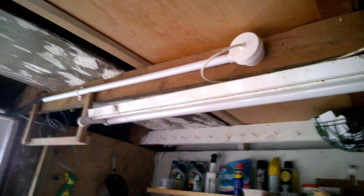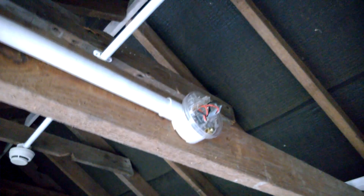You can even see daylight through there, which is not very good. I need to strip out some of this wiring — a lot of it is just redundant and needs to be tidied up and made safe, because as we know the wiring here leaves a lot to be desired. There's a random extension socket here, one hanging off the wall, a weird plug hidden away, and then a plug coming on here — kind of like a ring main going across. And the lighting is a bit loose and all over the place — it's all very hairy tape, as your father would say.